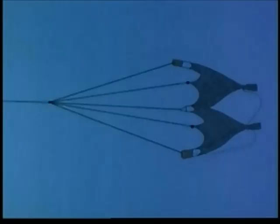When the twin trawl system was first developed, standard four-seam nets were commonly used. As the success of tongue nets became apparent, they were incorporated into the twin trawl system. This requires a five-bridle system. There are two techniques for rigging the five-bridle system. One method is to use five bridle legs of equal length. An alternate method is to splice the tongue bridle into the door bridle.